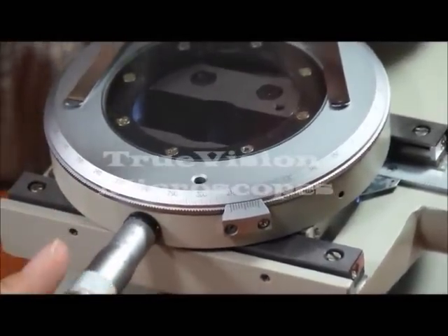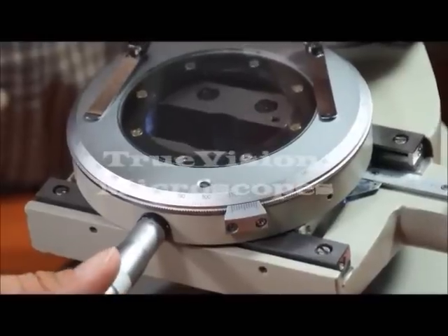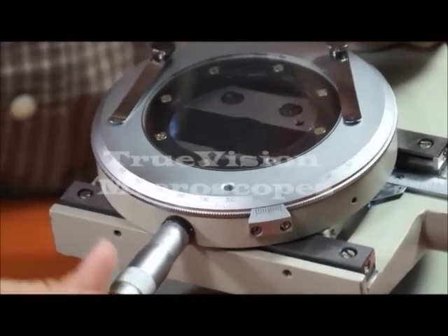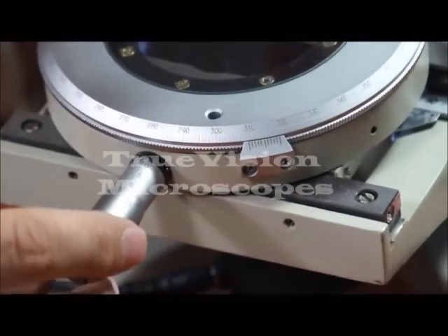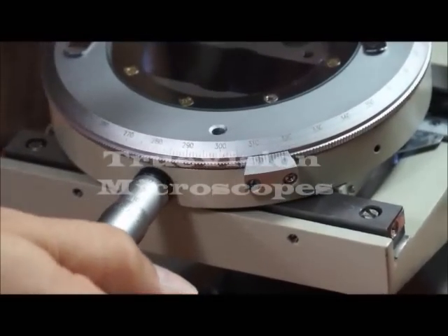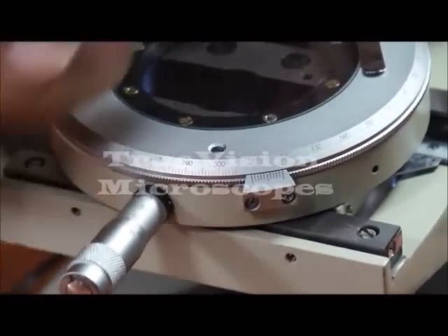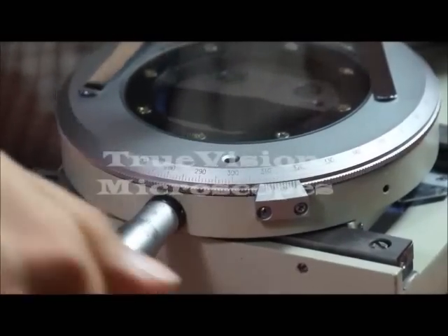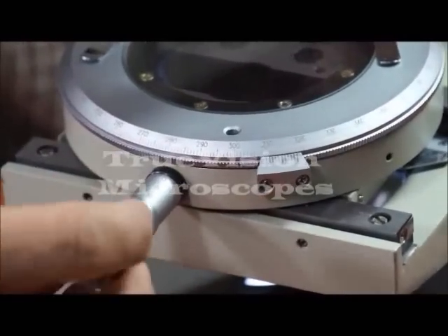Another click — that's two hundredths of a millimeter. Ten hundredths, twenty-five hundredths, that's a quarter of a millimeter. Fifty — well, there's forty-five all the way to zero. When I get to zero, that's fifty hundredths of a millimeter, equal to half a millimeter revolution — half a millimeter in the Y direction traveled. Making another complete revolution advances a whole millimeter. So to advance in the Y direction one millimeter, you make two total revolutions. You can read off the millimeters from zero to fourteen millimeters to see how much it's traveled.